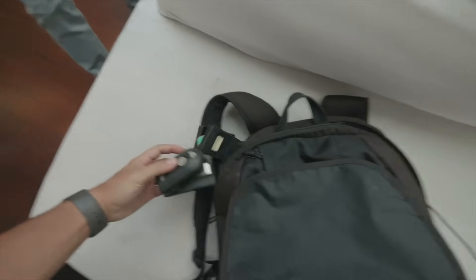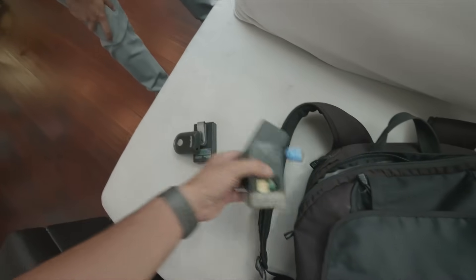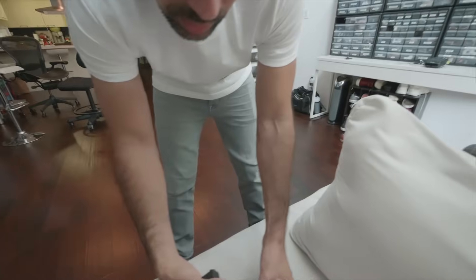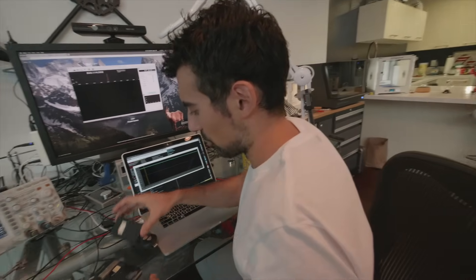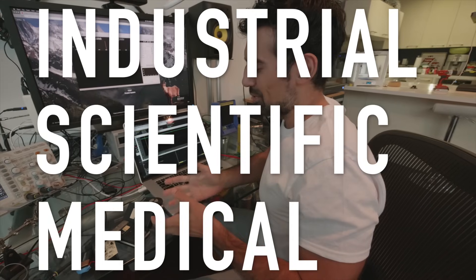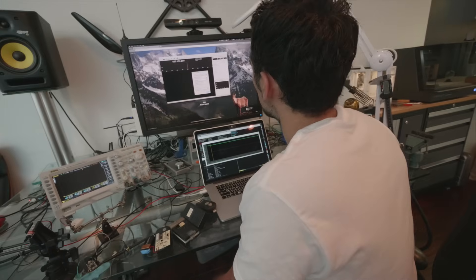And now, let's try to break into my garage. This is my friend Sammy. When you're dealing with garage door remotes, they're typically in what's known as an ISM band — Industrial Scientific Medical. Basically, they don't need to get really licensed to use those bands. Anyone can use them within some power rating within the US. And typically, it's going to be like 300 or 433 megahertz. So when I hit this button, look to the right. This is insane.